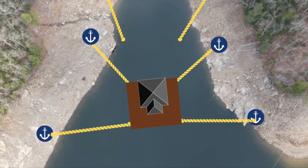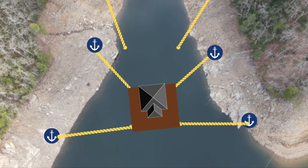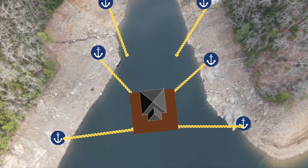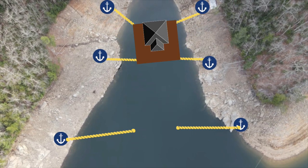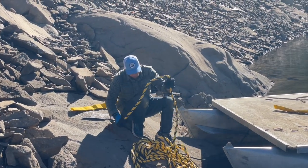So in the wintertime, when the water's down like this, we will have to sit further out in the cove. We will be utilizing the first four mooring spots. There will still be line on the back bolts because as the water rises, those will become inaccessible. When the water does rise, we will set the house back on the back four. As for the lines we're not using at the time, we'll tie bricks to them so they sink and aren't a hazard to navigation, then tie mooring balls to the bitter end so we can still access them when it's time to switch back over.